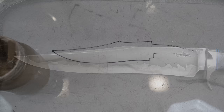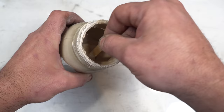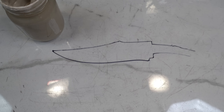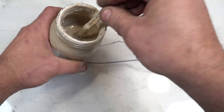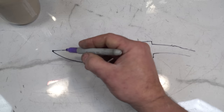Let's talk about the actual clay. There are a lot of different clays you can use for this. What I use — I have it in this jar — I think it's called Hamon Glop, and I got this from USA Knife Maker years ago and I just keep using it. You can also use furnace cement; there are lots of things you can use — find whatever works for you. One thing you don't want to do is put this on too thick. Put it on relatively thin — certainly no more than an eighth of an inch thick.